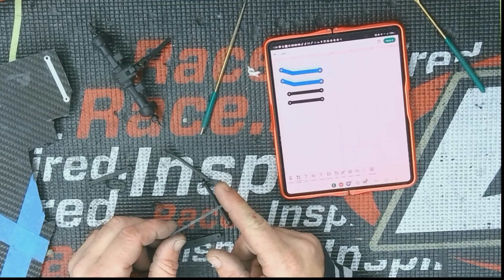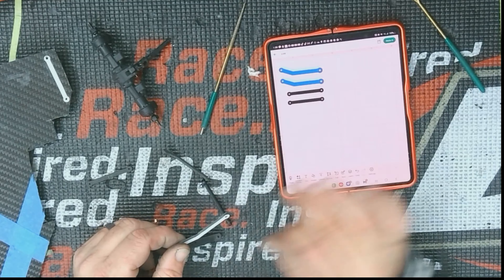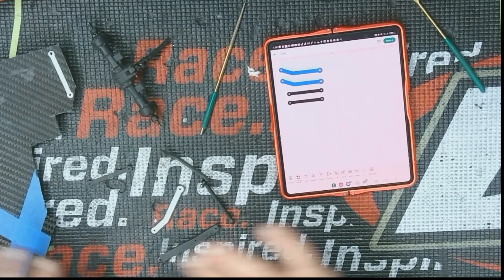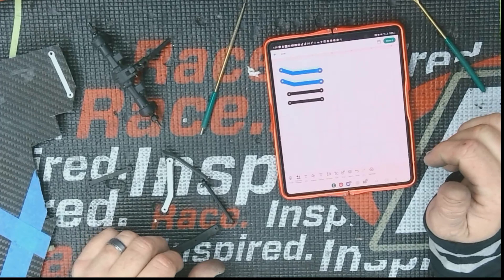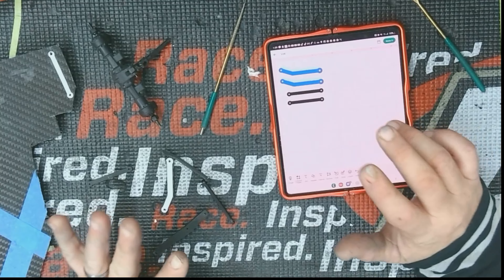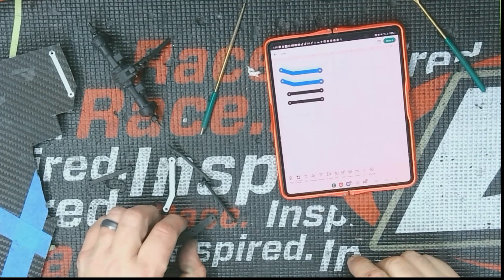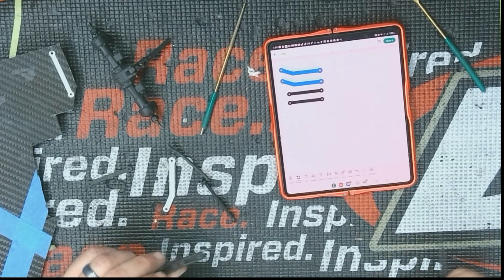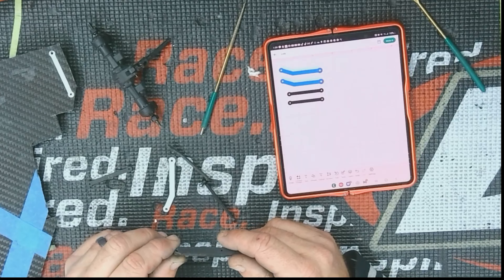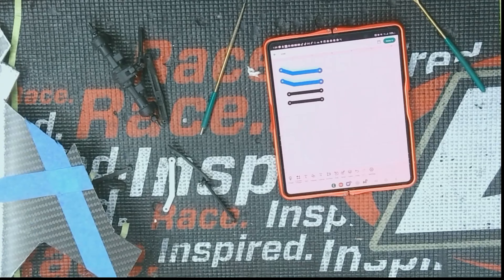What I did: took my picture, used the background eraser app to get my shape, put that into Cricut so I could print off a pattern to stick onto a piece of carbon fiber. I do this with so many parts that I need to make — take a picture, remove the background, put it in Cricut, make my pattern, put it on carbon fiber, and cut it out. If anybody knows a different or better way, let me know. If this helps you out on some project, I hope it does — let me know if you like this type of video. Thanks for watching.